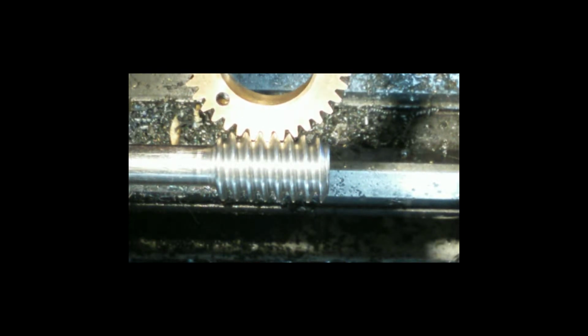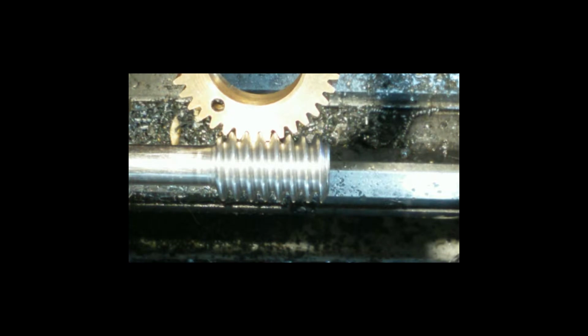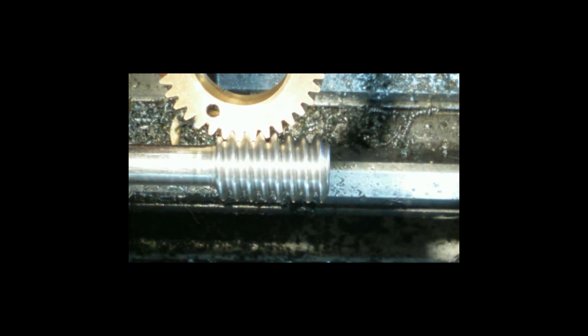So we'll start in the centre. I'm trying to line up on the edges so you can see the exact gear, because I can't get in the centre, you ain't going to see that. Look at it, it's glared. Right, so we're trying to get the angle so you can see it again. So the bottom of the teeth could have flattened out a little bit. The root, I suppose you'd call it, the root of the tooth. But the flanks seem to be in contact all the way down. And all the way up and all the way down. Oh yeah, that one at the end isn't. That's a misformed tooth, isn't it?